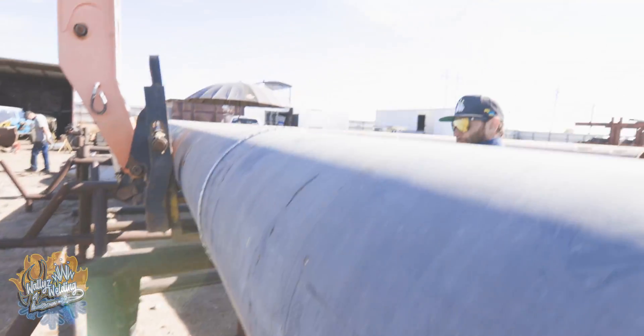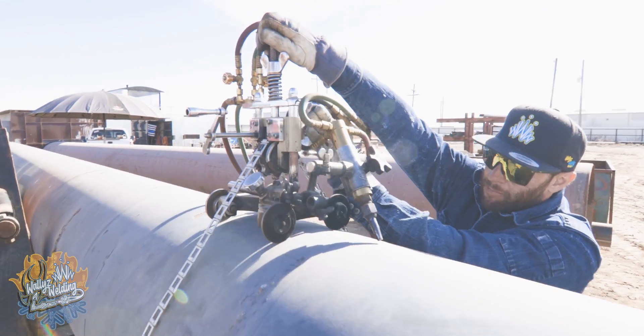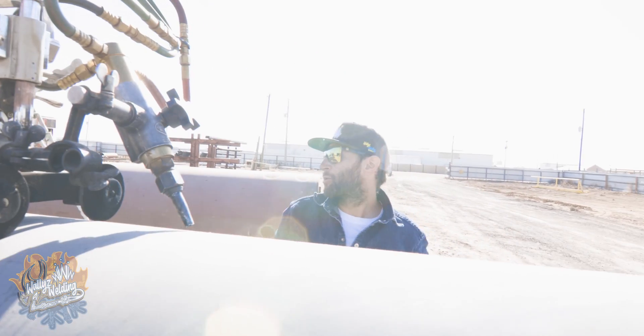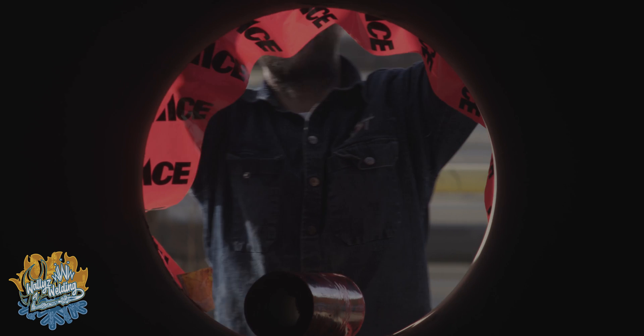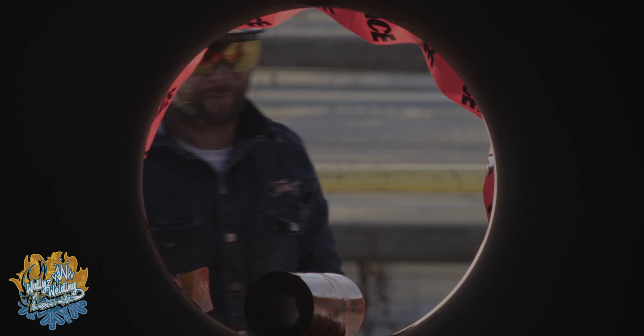I like it. So now I'm going to get up top. I'm going to hook up my oxygen acetylene. I'm going to take off the coating. Once I bring the coating off, I'll apply my cut. Right now we've got to make sure that the pipe is visible at the end with the traffic coming in and out, so we're giving it a red flag for warning.